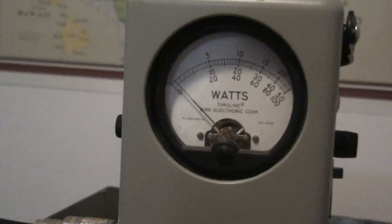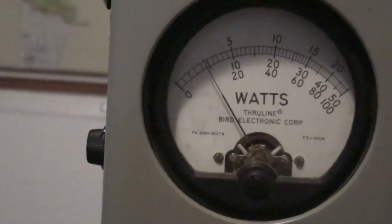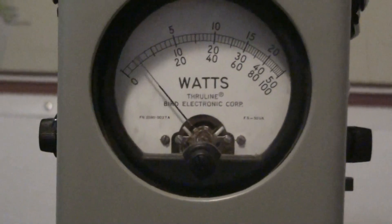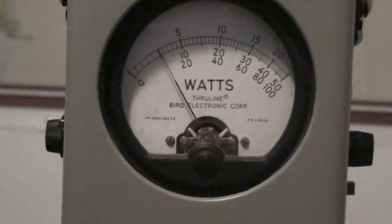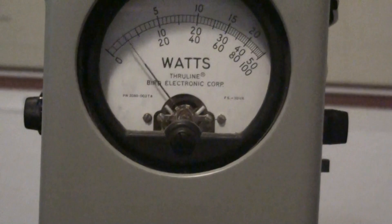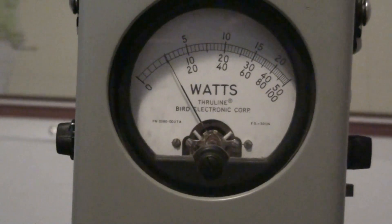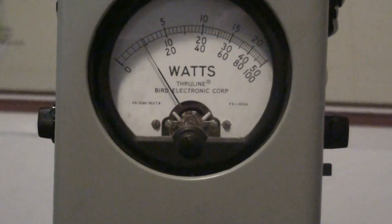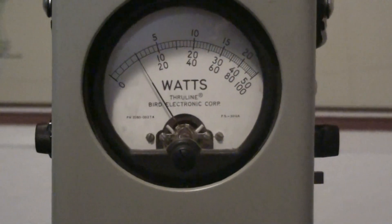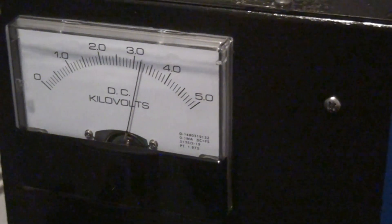Let's grab our mic here. Hello, audio. Right on the front side of 1,000. Hello, test 1, 2. Talking. 900 to 1,000. Just over 1,000. Slightly past 1,000. We're getting right around 1,000 watts average. The plate voltage dropped from about 3,200 volts to about 2,800 under load.